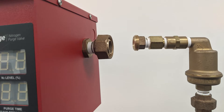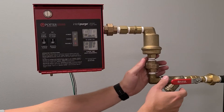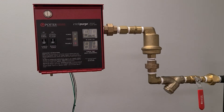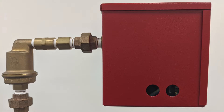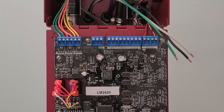Install the INSPV control box to the vent using the attached union and position for easy access. Caution: if the purge valve is installed in the incorrect orientation, the safety float will always remain closed and the INSPV will not purge. After installation, close the ball valve prior to hydrostatic testing. Using one of the half-inch knockouts located on the back of the INSPV control box, wire the 24-volt AC-DC power supply to the terminal marked E4.